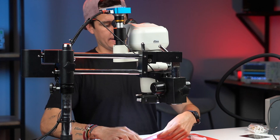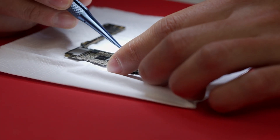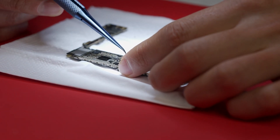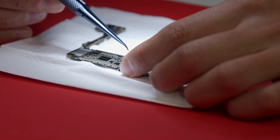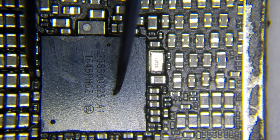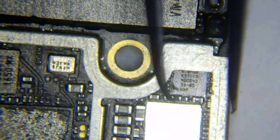We are going to hug the circuit and then lift the motherboard a little bit. I'm going to remove this circuit — this is the codec, the audio codec. This method can only be used with circuits that don't have this kind of glue or epoxy on them, because we're using the gravity method.